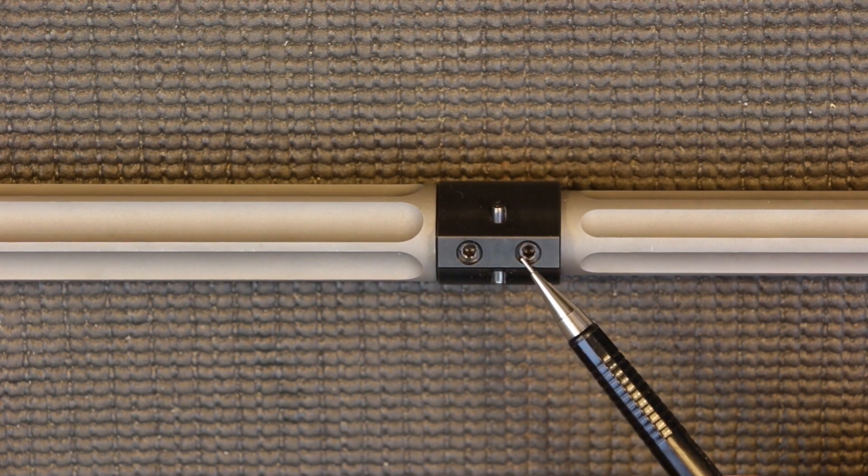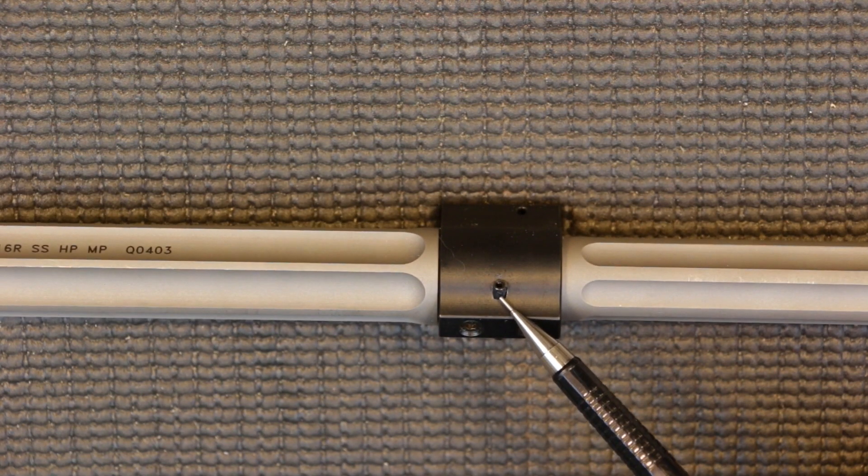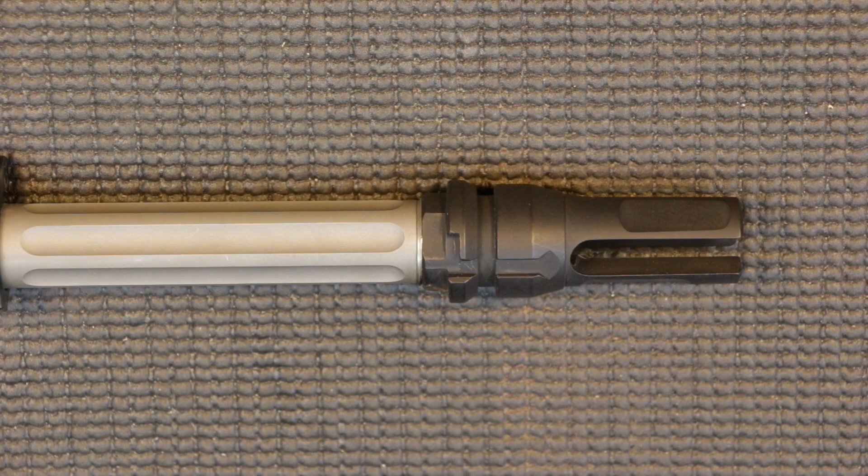I did notice that as I used my dimpling jig, the first set screw dimple location was just slightly off, but I went ahead and pre-drilled both holes to match up with my dimpling jig and still maintain the alignment of the pin. This is my preferred method to give me a bombproof installation — having both a dimpled barrel as well as a pinned barrel. Now let's touch on one of the most critical factors in determining and selecting your overall barrel length based on the setup of your rifle.